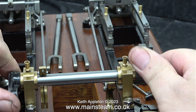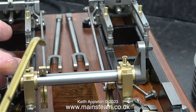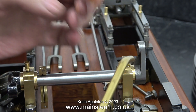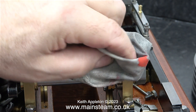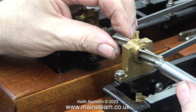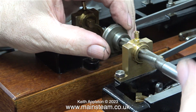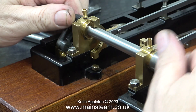I am going to need to run this in once I've got it all back together. A couple of things are still bothering me though: the massively over-scaled 2BA bolt heads obviously. But look at this oil cup — it's a bit out of round and it's not screwed all the way in. The oil cup on the left-hand side, believe it or not, is cross-threaded in the hole. I intend to change both of these, but I'll use them for the moment to apply some oil to the crankshaft. I wanted to check the fits of the main bearings, and yes these are definitely parallel and they are the right size, although the eccentric sheaves are a little bit tight.